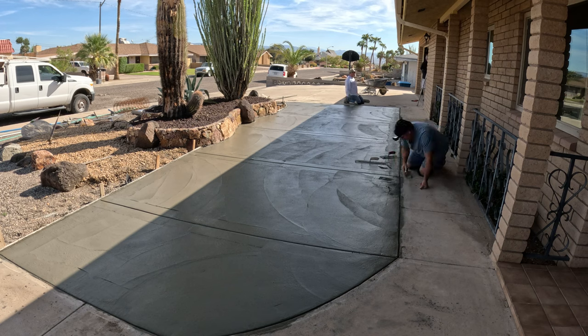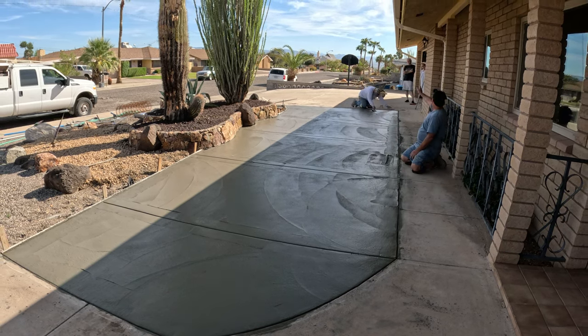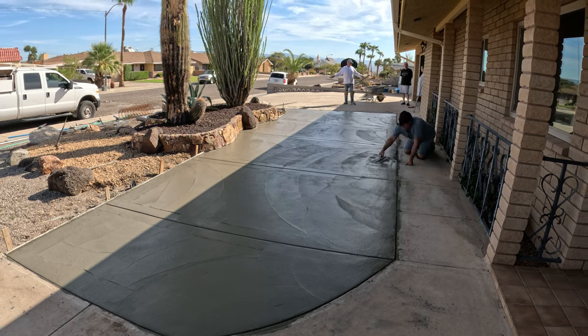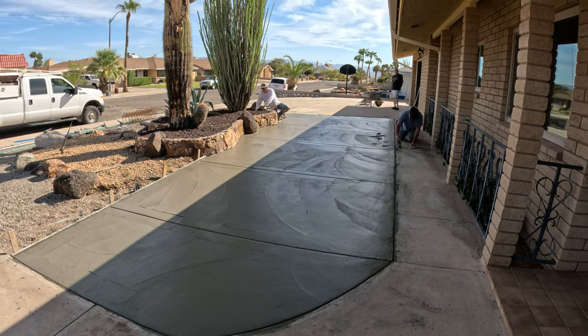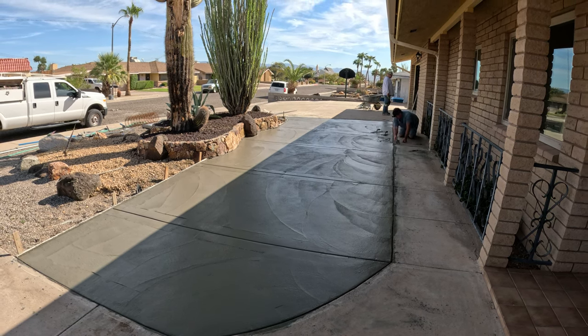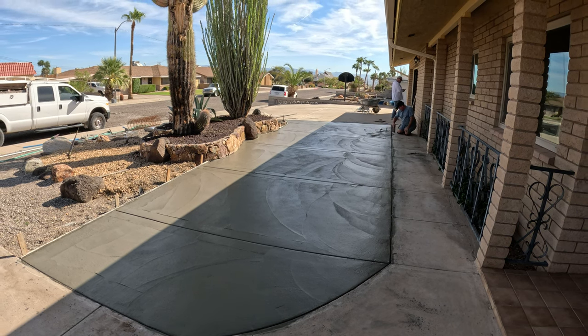Now this is the first pass by hand down this walkway. And this is the time you'd want to clean up any residuals on the walkway. And that's what I'm doing here. Also, this is the time you really want to flush it out. When you get down there low like this with the hand float, you can really see if you're perfectly flat coming across that seam.